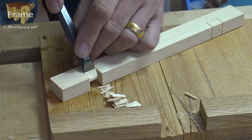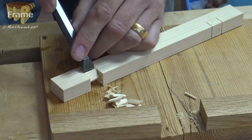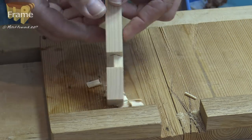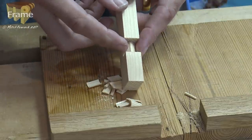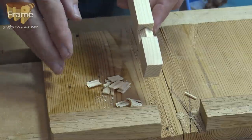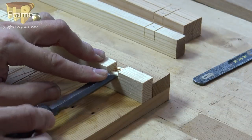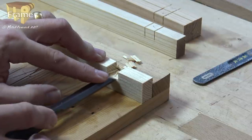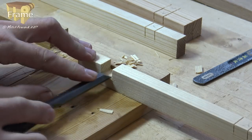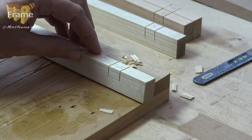Finish down to the gauge line on the other side. It should be fairly clear — we've got a raised section there, a triangular section raised in the middle. We just lower that away from the top, paring straight across until we get back down to a flat surface. And we simply have seven more of those to do.